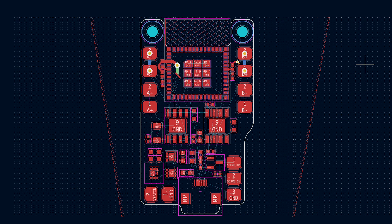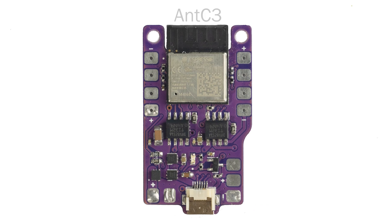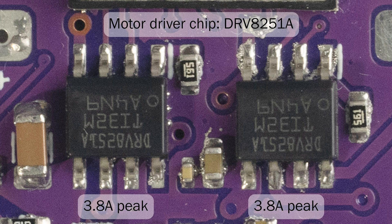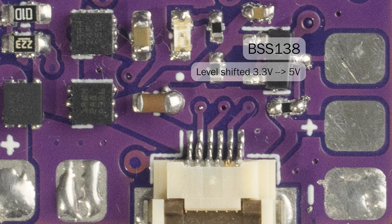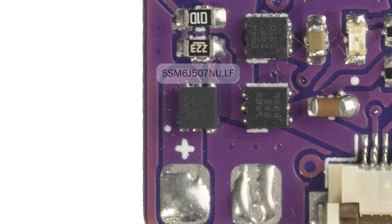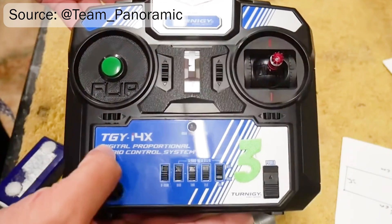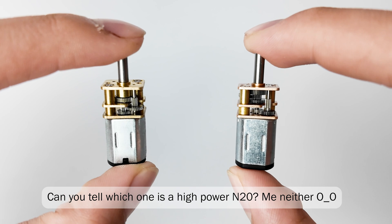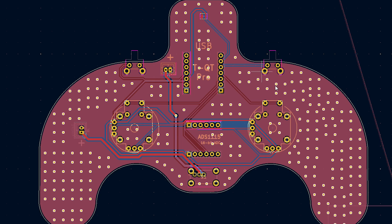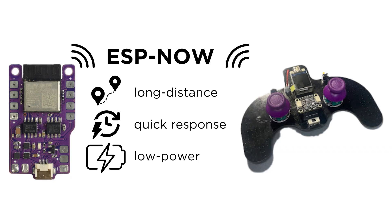Instead, I'll reinvent the wheel for your entertainment, which is why I made this little board named the ANT-C3, with motor outputs which can handle more than double the current, and controlling capabilities for all ESCs and servos with a 5-volt signal, not to mention the reverse polarity protection. This not only eliminates the need for one of those really fat radios, but also allows me to use up to four high-powered N20 motors. I also designed the transmitter with an ESP32-S3 display, because ESP-NOW will allow the two to communicate.